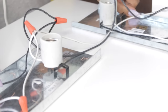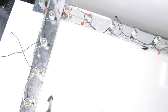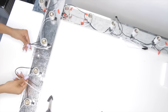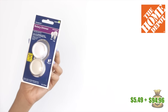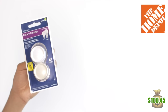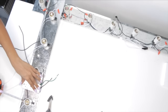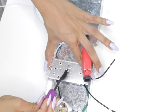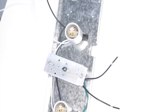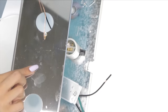For this side of the light bar I also drilled a hole in the vanity so the chrome plates can lay flush and flat when hung on the wall. I'm going to connect the power and the dimmer to this side of the light bar. I got my dimmer from Home Depot — it was super inexpensive. When choosing a dimmer, make sure it is compatible with the wattage and the type of light bulbs you are using. I placed my dimmer in the vanity strip to make sure it fit and could close once I put the chrome plate on top. For precision, I used my mascara — just put a little on the knob of the dimmer, held it in place, then put the chrome plate over it, and when I turned the plate over it marked the exact spot I needed.